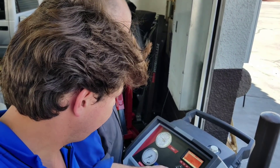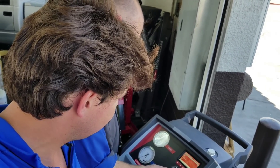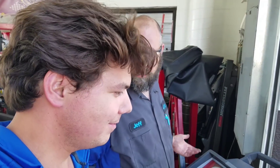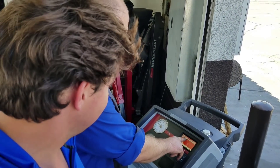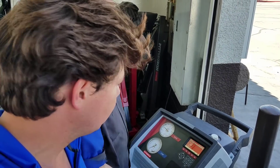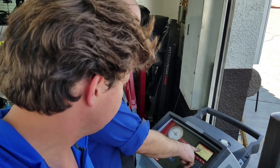Here's my little book picture. We have a 2015 Dodge Grand Caravan. We're able to identify a couple of the pipes that go down and backwards, which means we have air conditioning in the rear — it is with rear AC. It tells me the total capacity of refrigerant is 2.538 pounds. This machine is amazingly accurate. We're going to hit go, and it automatically populates the charge weight.